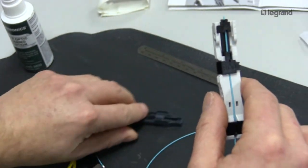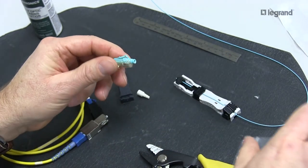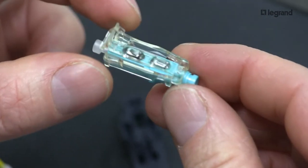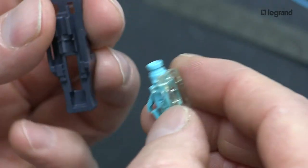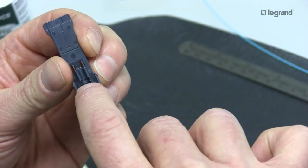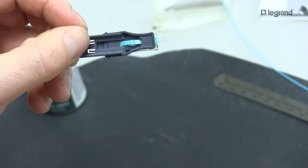I'm going to pull out a connector. Remember, this is a mechanical connector — there's actually a spring load in here. What's keeping that spring loaded is this plastic cap. You notice the two ends here? When you push these, this cap is going to pop off, and when that pops off, that engages the cam. I'll put it back into place for now because we're not ready. I will load my connector into the jig. There's a little lip on the front of the connector and also on the front of the jig — tab down goes into the hole. When I put this in correctly, it engages and locks into place. I should be able to turn it upside down — see the tab?